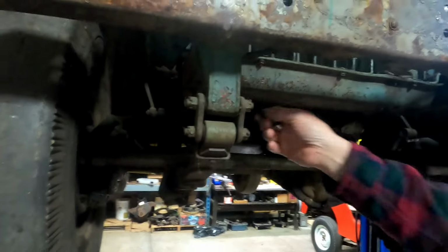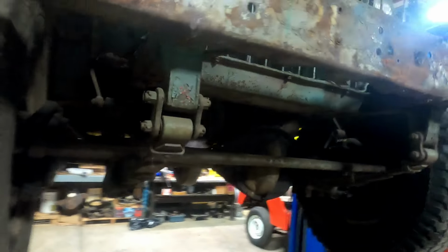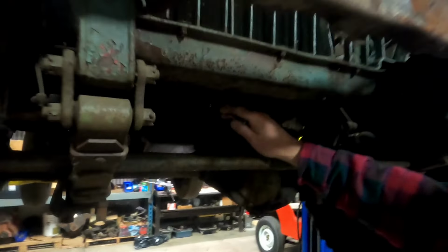They were good about riveting frames. These were riveted frames that would flex. The engine is basically a 9N tractor engine. If you look at the way it's set in there, it's a long stretch, and when they would jump them, it would break that front engine support. That was a common part for them to fail.